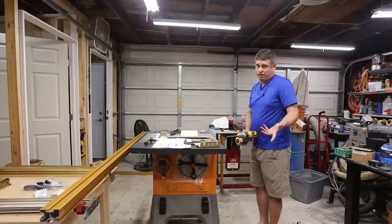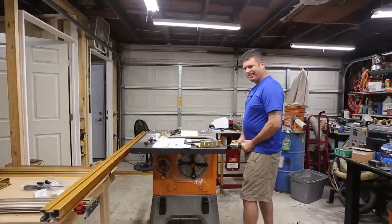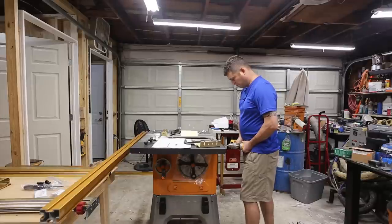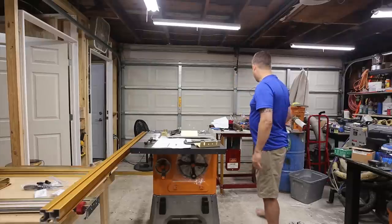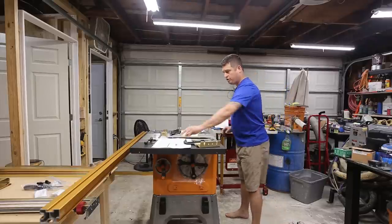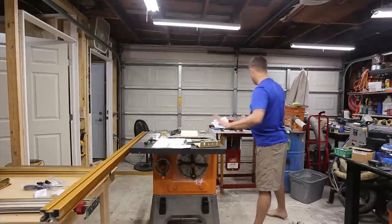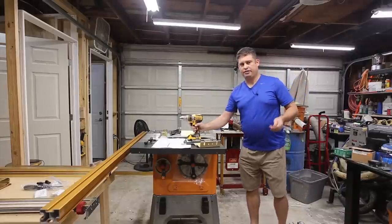So there you go. You just go slow and gentle, firm but gentle pressure. It generally creates dust. If you go too fast, you run a substantial risk of fracturing the cast iron. And if you go just nice and slow, you shouldn't have any issues, at which point I'm still just a little short, so I need to find a little bit bigger drill bit. And it's not uncommon to have to do this in steps.